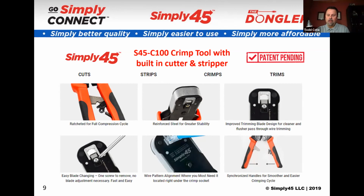And then we have cutters and strippers and everything built into the tool. Plus, we kept ratcheting, which a lot of tool manufacturers are getting rid of. Ratcheting is very important, it's not a noisemaker. It actually ensures that you are cycling the tool to the proper depth, so you're not under crimping and you're not over crimping, right? So it kind of takes you right to it. And when you hear the click, it's done, and then just release. So these are really important.